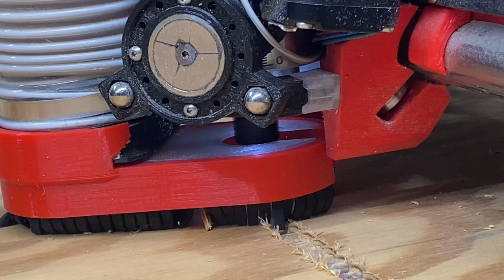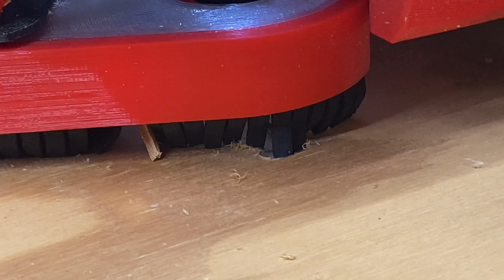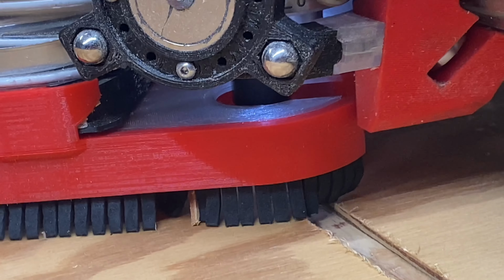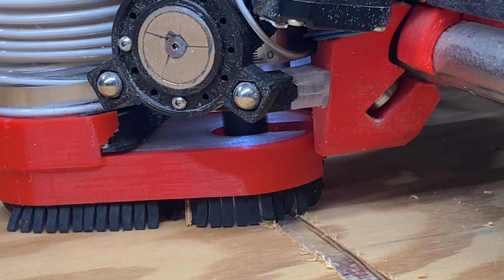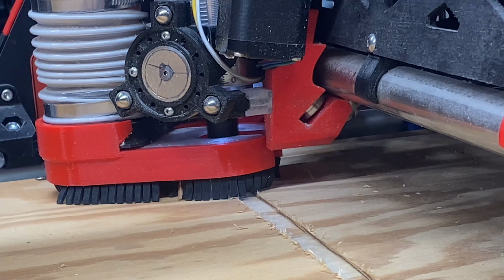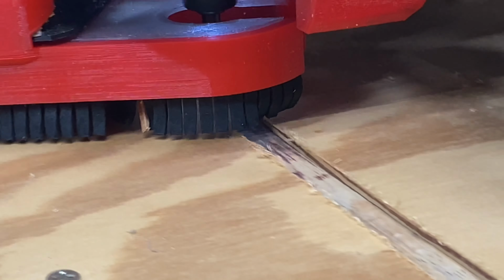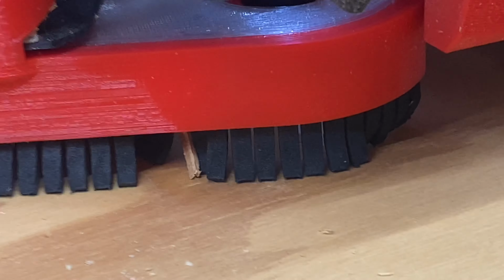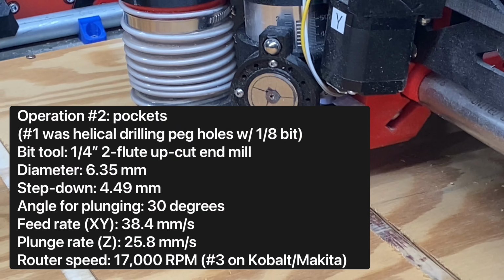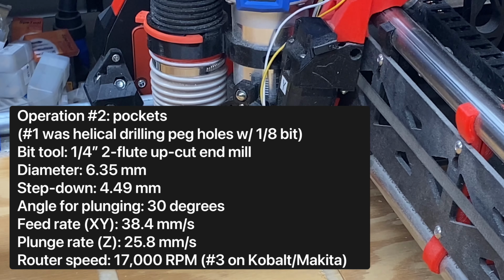As it was, I was continually having to run around and check whether screws were being hit on the periphery, and even moving screws from one place to another to keep them from being hit, because I was using a 1/4 inch end mill instead of a 1/8 inch. You can really get this done with a 1/8 inch. And aside from the part of rabbeting out these grooves, which was a pocket operation, I really wish I had used a 1/8 inch bit on the profile cuts. So I've made a mental note for next time to try to remember to do that.